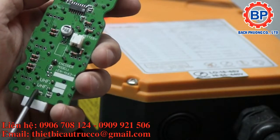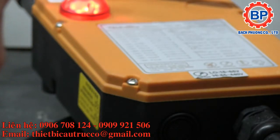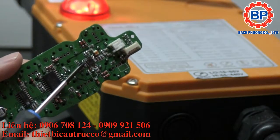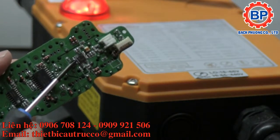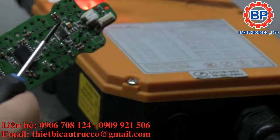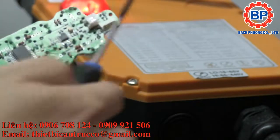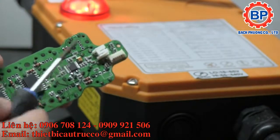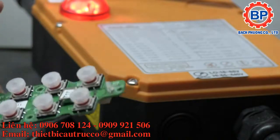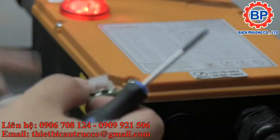encoder model, VHF, UHF markings, which weren't populated, and then a very hard to decipher set of markings on this chip up here. This guy looks like it maps over to the antenna. There's a little tiny inductor right above it, so there's an LC network going on right here, right before the antenna connector. So it means VHF, you don't really need too many impedance controlled traces in this neighborhood. It works. For range, I haven't tested it yet, but I'm sure if I have issues, I will report back. But otherwise, it seems alright.